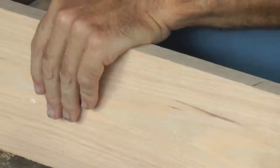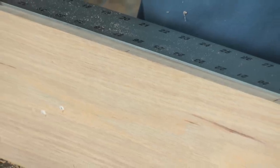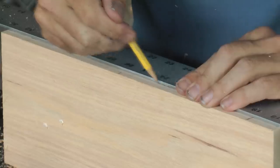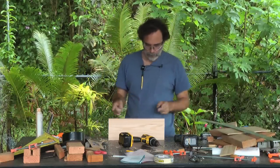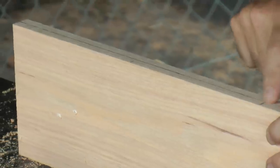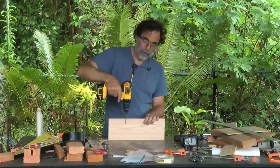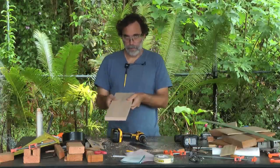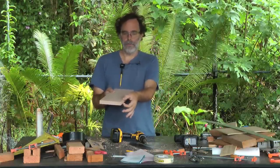I'll put a little mark halfway and then take a straight edge. So now I have 14 inches marked off, the halfway marked off, and a line down the center. Now we're going to drill holes on one half of that — between here and here, all the way through. And then we're going to put it on a table saw and rip off a couple of strips to make your proportional divider from.